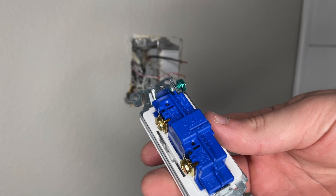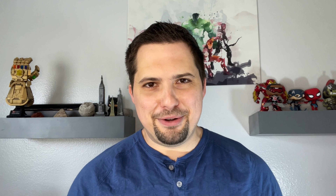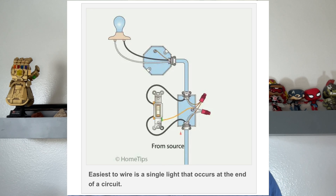Let's install this new outlet — and it's at that moment he knew he messed up. I normally don't interject commentary into the middle of a how-to, but I felt it was necessary to explain the thought process that went through my head and how wrong it actually was. When I took the switch out, I was expecting it to be a straightforward one-way switch, but what threw me off was that on the back of the smart switch, you have your two wires — one going to the light, one bringing in power — but they had the neutral connected into the switch, and it actually says to put your neutral wire there. A typical wiring diagram for a single one-way switch shows that your neutrals are tied together outside of the switch itself — it's not something that normally plugs into the back of the switch. So I needed to take a break and figure out what I needed to do going forward.